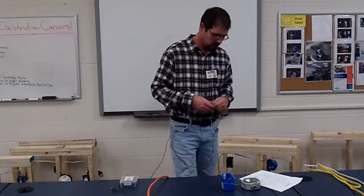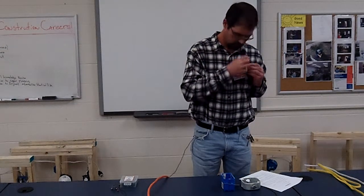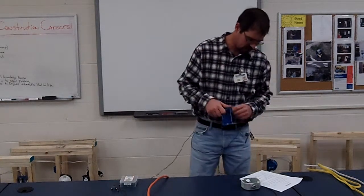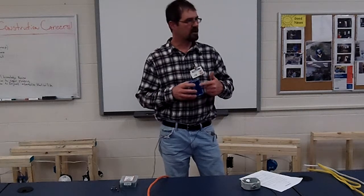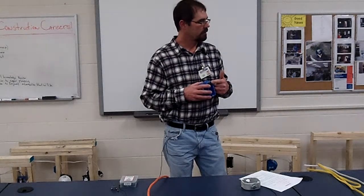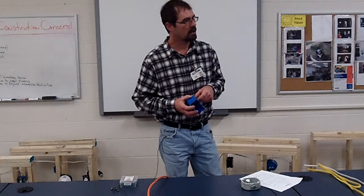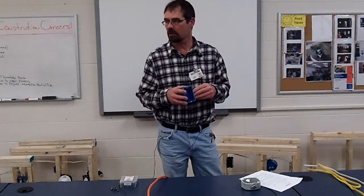So that's important information. When you're mounting your electrical boxes, you need to leave them stick out how far past the framing? The face of the box has to be within — it's about 3/8ths if you're using 1/2-inch drywall, and that's what these ears are, about 3/8ths. But it's got to be within 1/8th inch of whatever material you're covering.